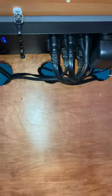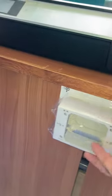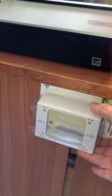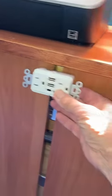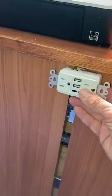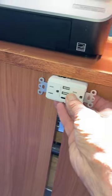It's kind of way over there, but my plan is I've got a power strip on the underside of the desk. I'm going to run a power cord from the power strip, run it along the side, drill a hole through the back of my filing cabinet, and run the cord on the inside above the drawer. The cord will come out right here and go into a plastic box mounted right here — with an outlet that has a couple of USB connections and another charging connection as well.